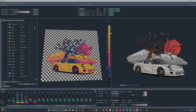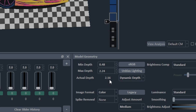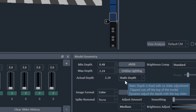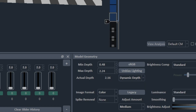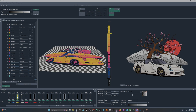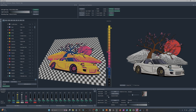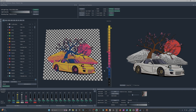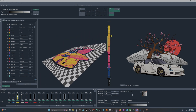This particular HueForge is showing an actual depth of 2.16mm — that's pretty thin. Next to it is a dropdown for how to set the depth or thickness of the HueForge. I typically set it to static depth. Dynamic depth bases itself on your topmost layer — as you scroll the top color up, the actual depth increases because you're building the mesh up. With static depth I always know how thick it is at all times.